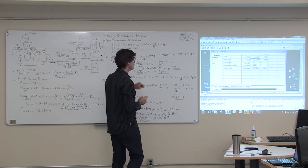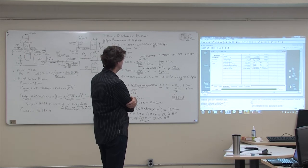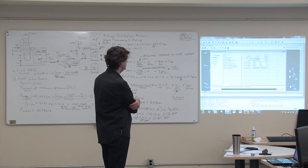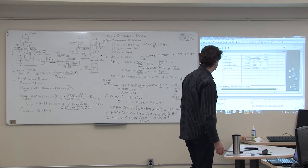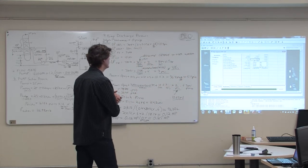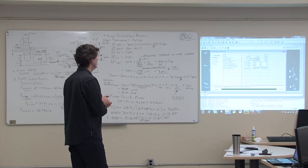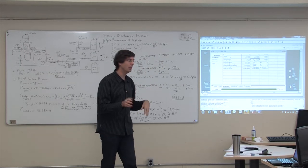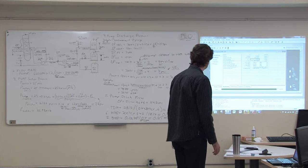The result from the Crane table was actually conservative compared to the HYSYS result for the two-inch line, which was unexpected given the higher viscosity. There are other pressure drop programs available — online tools, ones on the wiki, and a good one written by Bob Heslip. For now, we'll move on to the NPSH calculation.